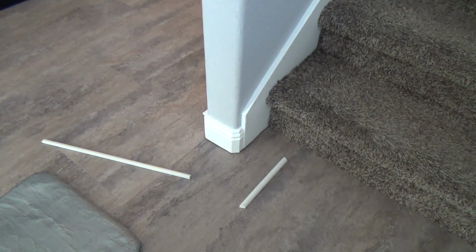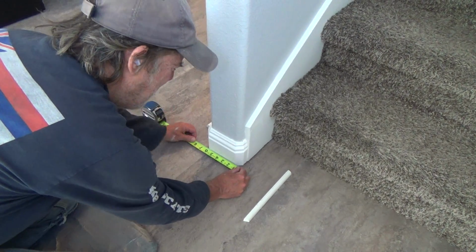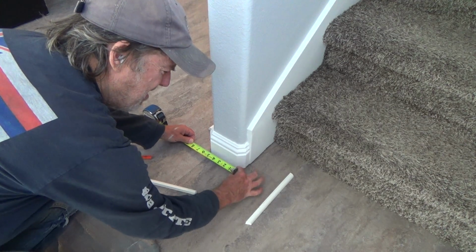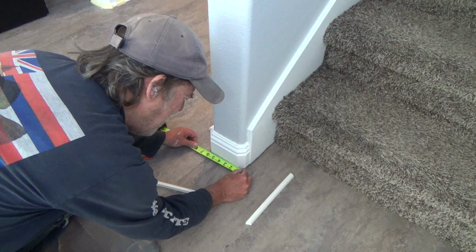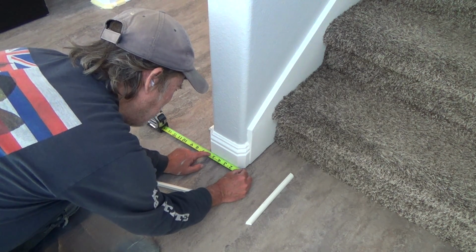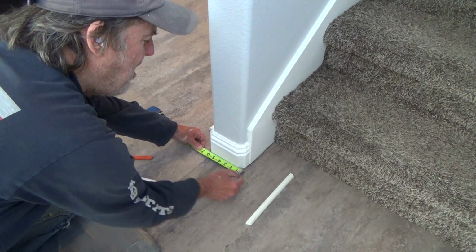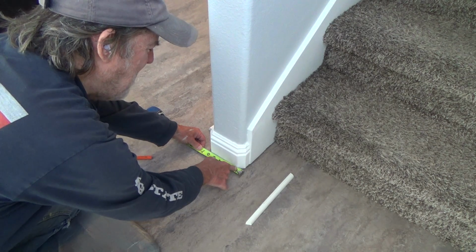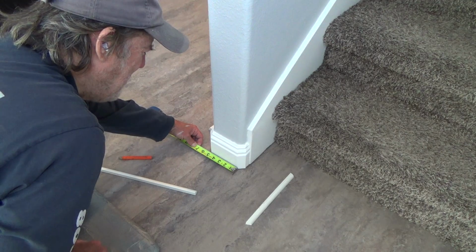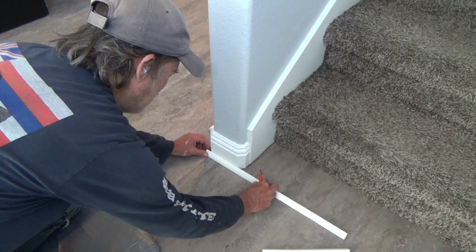this one here, sometimes I measure this and line it up, and I'll burn an inch just so that I don't have to hold it on that and then hold it up here. And see, that says 5 and a long half inches. So then when I hold it on my piece, I can measure it right at the 1 inch, let's say. Or I can subtract the inch, whatever. Okay, I could do that, or I can do this.